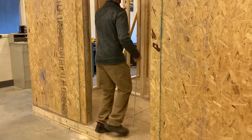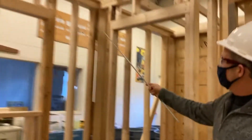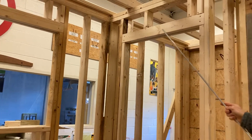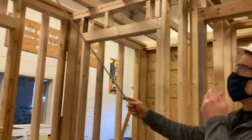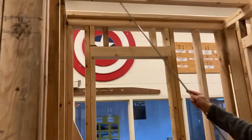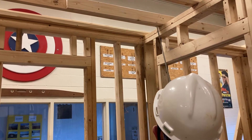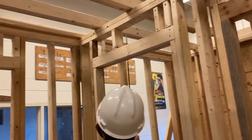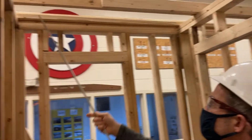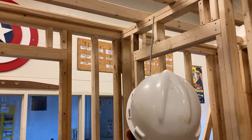After that, we moved in here and we kind of finished up this interior wall. This is a bearing wall here — this would be our main bearing wall coming down the middle of the house. How we know that is it's perpendicular to our ceiling joists. Our ceiling joists are resting here — going from here to that wall are resting on this wall, and going from here to here are resting on this wall. So this is a bearing wall.